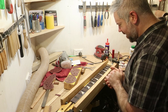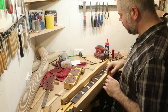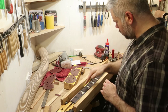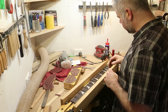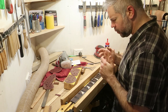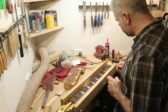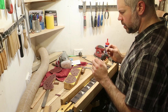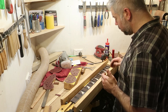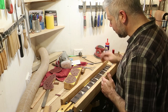It is the next day. All this glue has fully cured. I've set it up in the jig and we are going to go in with some 80 grit — just to knock all of that down. As soon as we get the bulk of it off, we'll switch into the 120, and probably 240 as well, just to get it nicely smoothed out and leveled and ready for actually applying the final finish, which of course will be CA glue. But it'll be a lot smoother than it is now. Let's get cracking.